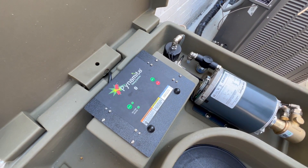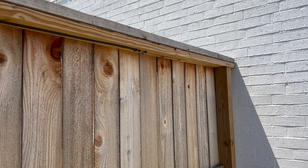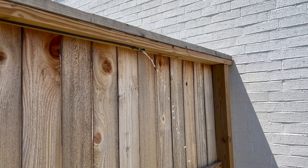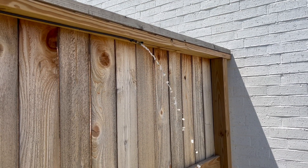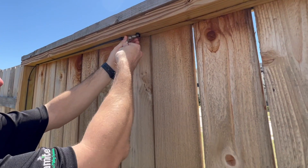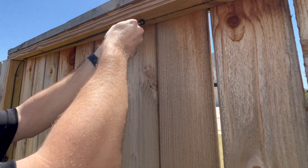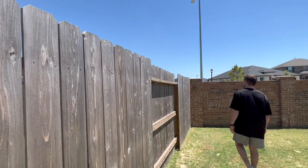The remote control will not initiate a mist unless the app has already been set up. Inspect the nozzles you removed — water and air will be purged out of the system. Once the water is running without air sputtering and the inspect cycle ends, replace the nozzles. Walk the system to make sure all nozzles are misting properly.